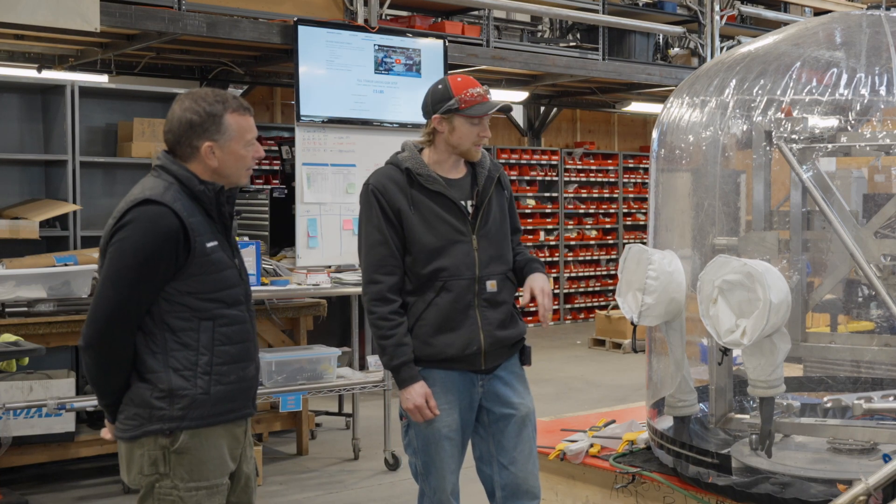So we made the jig out of stainless. The welder works like this, so that means this jig has to be able to be moved around from inside — that's why it's on wheels. We made it rotate in many directions so it's easy to get to the spot that you're welding and make it as comfortable as possible. But it's still pretty hard to get to where you're trying to weld. You have to have everything in the bubble before you start, though you can pass things in and out. We have a little tube here — you put the parts in, purge it out, open up a second gate, and then the parts can go in. But basically you have to have most of what you need in there ready to go before you start.